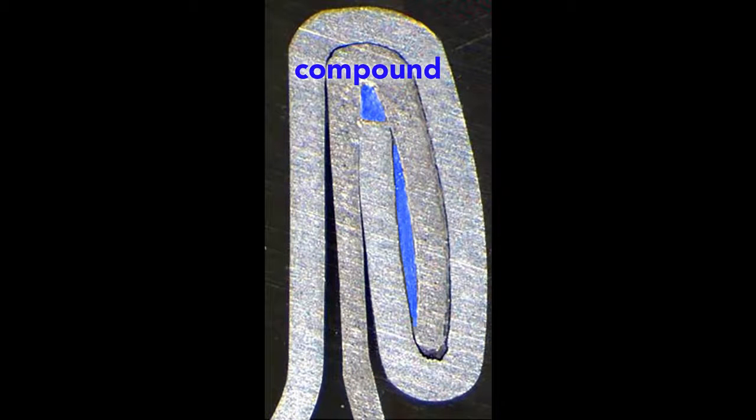In addition to the clamping, a sealing compound ensures that no gas escapes through the double seam. The compound is applied as a liquid, then hardens to form a gasket. The end, attached immediately after the can is filled, traps gases inside the can to create pressures of about 30 psi, or two times atmospheric pressure. In soda, carbon dioxide produces the pressure. In non-carbonated drinks like juices, nitrogen is added.